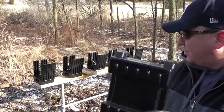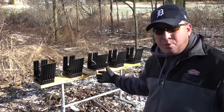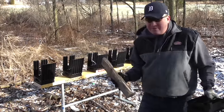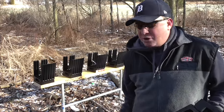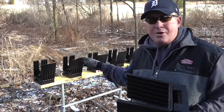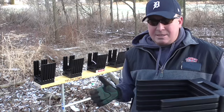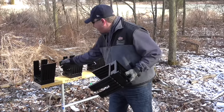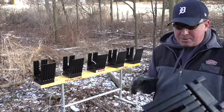Each cup requires four screws that are mounted down onto the board. One of the things you have to figure out is what width you want to cut your firewood to, and then adjust your tipping cups to that. For instance, I cut my firewood at 16 inches, which I think is a little bit longer than a lot of the European firewood. If you see the Truncater video, the cups are a lot closer together — they probably cut like 9 to 12 inch logs — and a face cord is typically 16 inches. So I had to put about 9 inches in between each tipping cup, which is more than what they recommend. But we're going to see how it works — that might work out well.